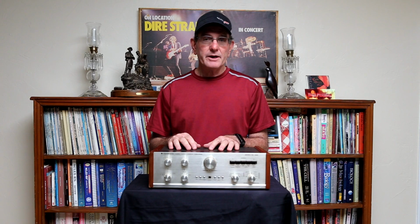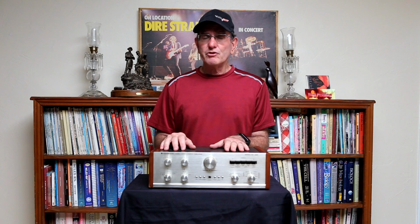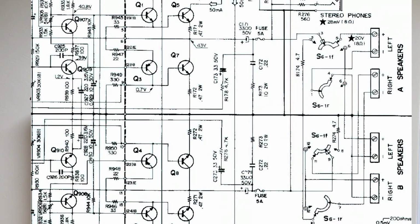The wiring was done very nicely. It uses a single 90 volt DC supply rail, and the output transistors are all NPN devices. However, there is a pre-driver PNP device on each stage. So I'm thinking it is a version of Class AB. It also runs fairly cool.